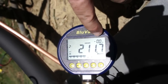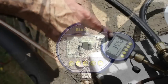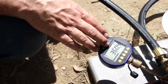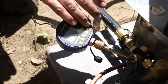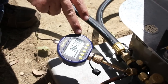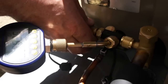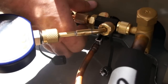Now our indicator's at zero, which means we're not making any progress — right here's where we stalled out. We've been on here for about 10 minutes or so and we're not rising appreciably, so we're going to go ahead and say this is good to go. I've got the core tools isolated right now and I don't want to take my micron gauge off yet because I don't want to introduce air into the system — if I pull the micron gauge off, we'd pull air right through the side of the core tool. So I've got these two closed. I'm going to go ahead and shut down my pump and disconnect our two hoses.